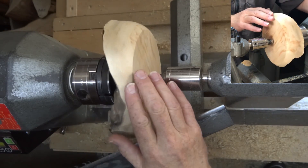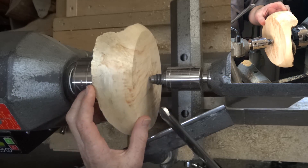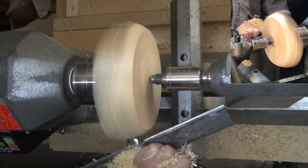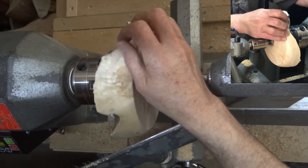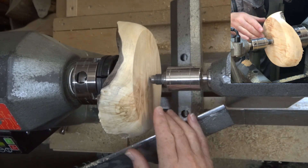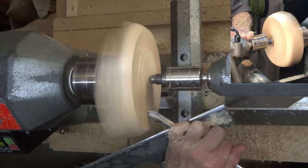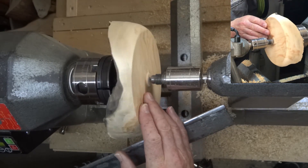I don't know if it's just this piece of wood or not, but this area I'm having a problem — just getting a lot of chipping. So I've just freshly honed the edge of the gouge and let's see if that'll improve this at all. Well, it was cutting better, but there's still going to be some sanding done here. I just want to make a little bit of a concavity on the bottom here, and that cut fairly well.